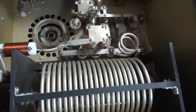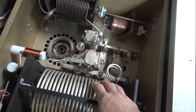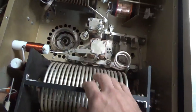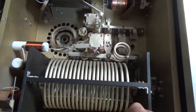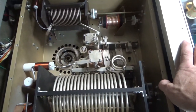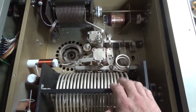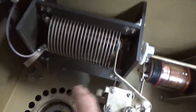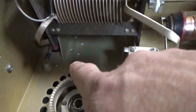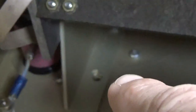I don't know what I'm going to do with this. I would have to take this inductor out and have it rebuilt. The shaft is definitely shot, the roller wheel is probably shot, and these parts were made at Henry Radio — it's not like I can just go buy one. I'd probably have to see if Contronic Labs can help me out again. It also looks like someone took the edge-wound inductor out at some point, because there's a mounting screw missing.